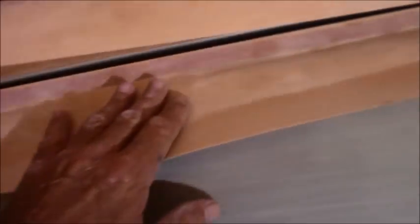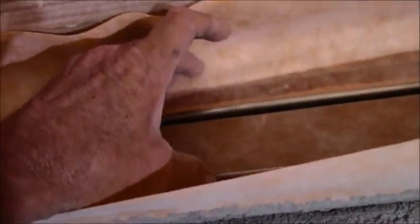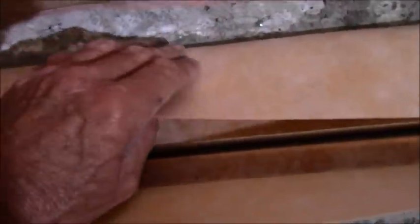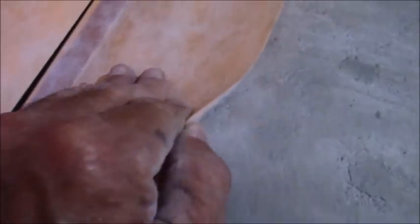I said this is a Schluter drain, so it has this fleece cover that encapsulates the whole drain. And now that everything is done, I can go ahead and use thin set, because I'm gonna knock that down a little bit too. I can use thin set in the back of here. I'll just put thin set in the back of here, push that up against here, kind of thin set onto the wall. I'm gonna put in the scabbing, by the way, 2x6 scabbing will go up here. And so then I'll just press that into the thin set all the way along the back, do a little fold in the corner, and then all the way onto the face, up onto the front, as it were. So this will get thin set down to the finished floor.